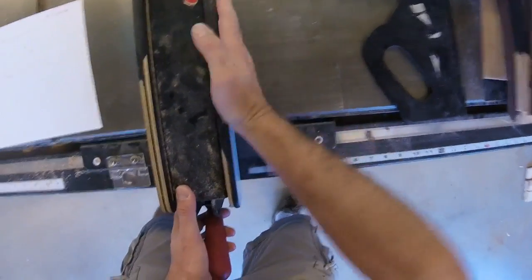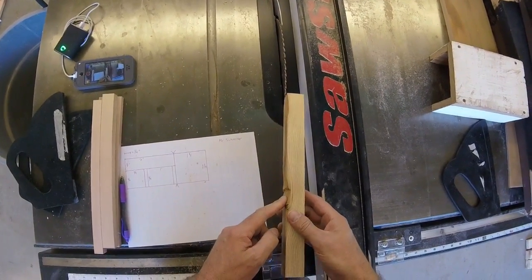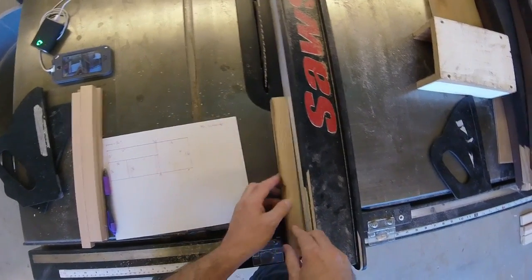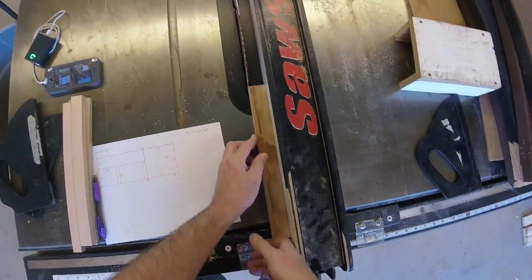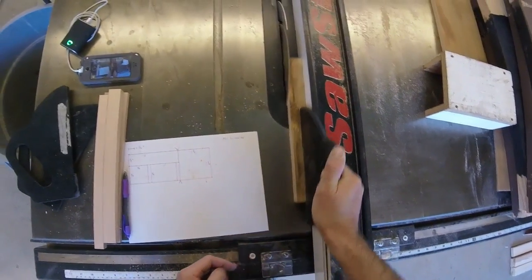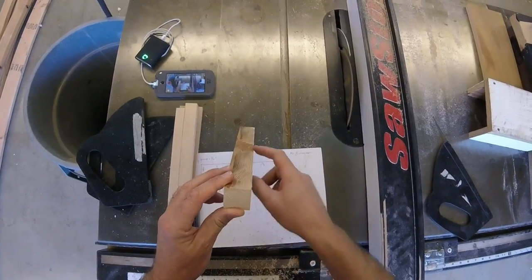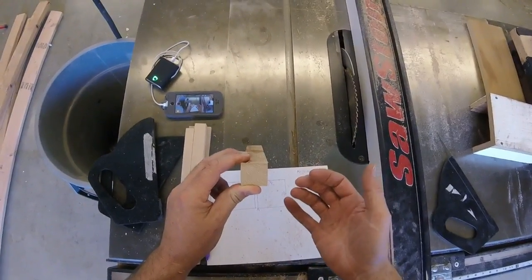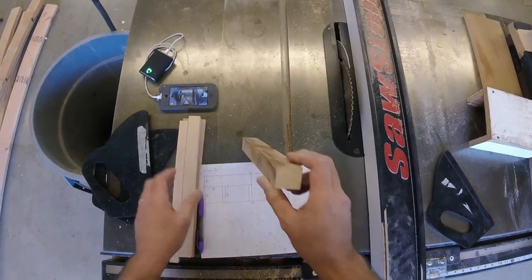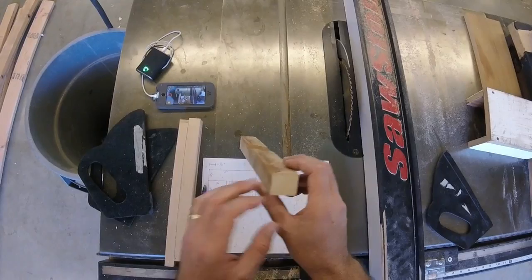So now I have three of my four boards cut. I have my two-inch piece, my three-quarter by three-quarter, my three-quarter by one, and I'm left with a one and a quarter by one and a quarter. My last setting on my table saw is one and a quarter. This is the edge I want to get rid of — I'll want to save these two edges. And unfortunately, as you can see, I cut that too small. You can see that by choosing a piece of wood that was too small and by over-machining in the beginning, I've made this unusable for my project. If I were making a jewelry box out of this, I would have to start over and find a new piece. If we were making high-end woodworking, we would want every component of the box to come out of the same piece of wood so you've got the same grain and the same color.